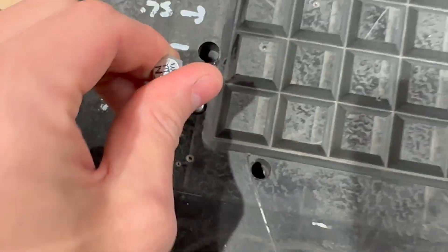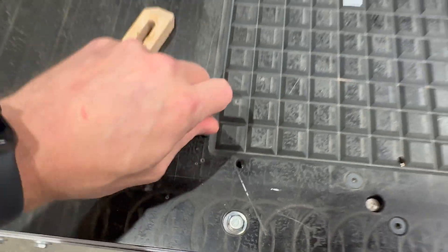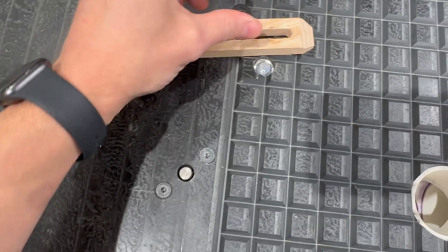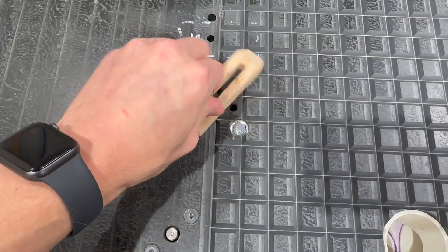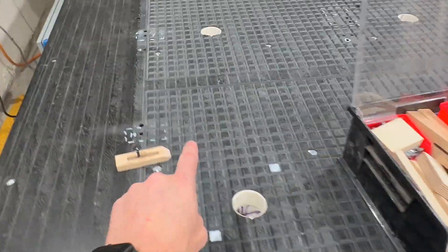We've tapped through the steel so you can bolt things into the table — you'd be able to see it from below. You can then bolt down something like a clamp. We don't ever cut directly like this because we want to preserve the nice expensive phenolic top, so we'd put some type of spoil board on top.